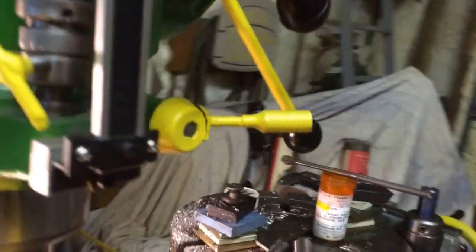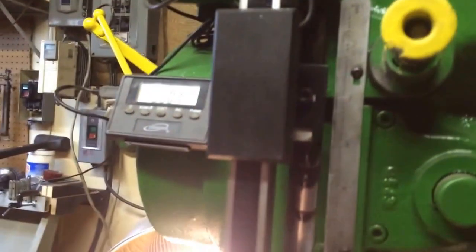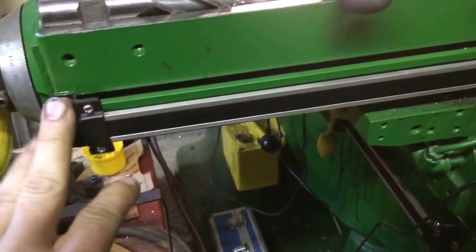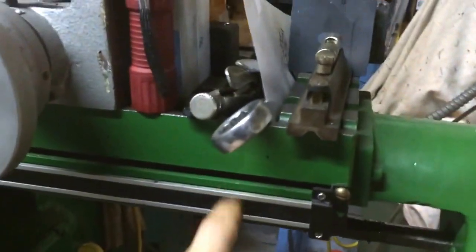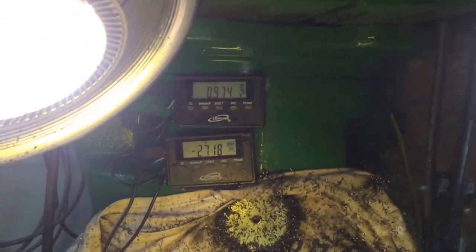These are the ones I have on the mill. These ones are attached with just a little block on the bottom holding this one — unscrew to release it, and it's self-aligning. The wheel handle goes up and it's attached by another block of aluminum — looks pretty good that way. I did put a handle extension on here. This one on the front I'm eventually going to replace with better scales. It's fastened in the T-slot there for the stop for the power feed, and the scale reader heads are back there. The last one just sits right here with some brass screws.